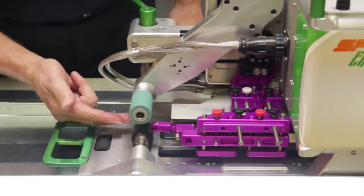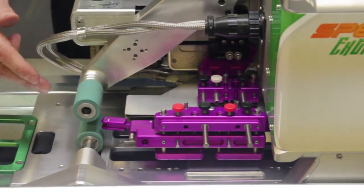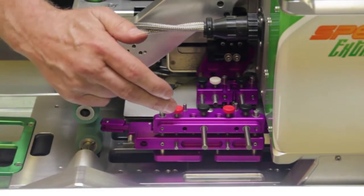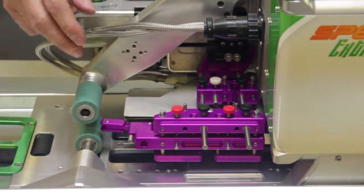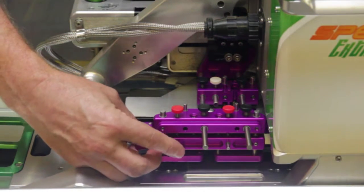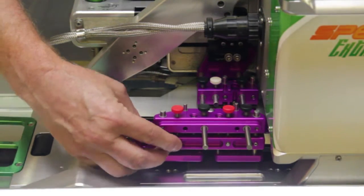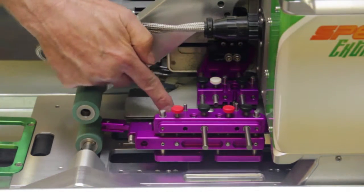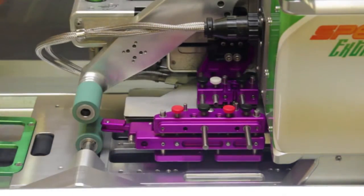Do the same for the lower pressure roller as well. With the 2 inch (51mm) rollers installed and the lever arm in place, next loosen the three red screws so that you can slide the inner bar — easiest to slide from here — all the way out so it comes to a parallel position with the top mounted piece. Once there, tighten the three red screws.